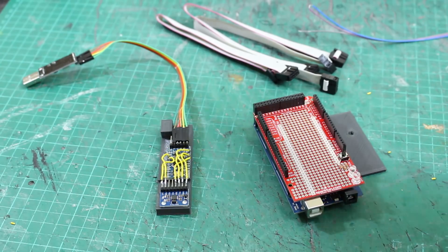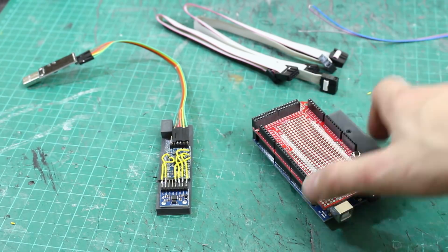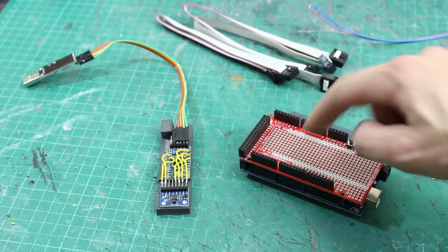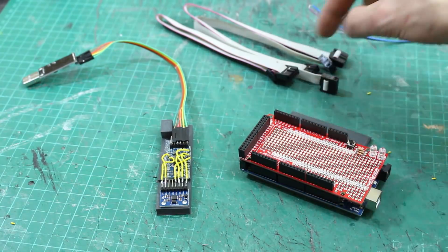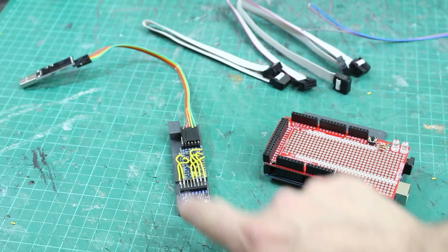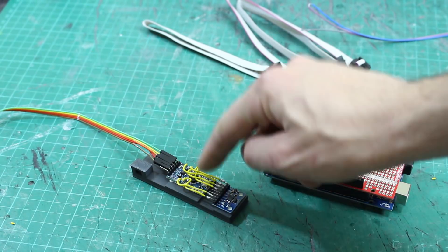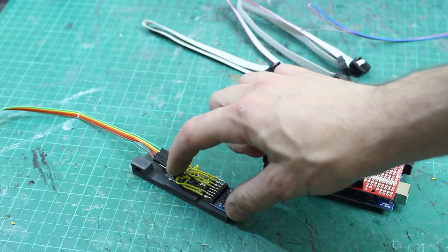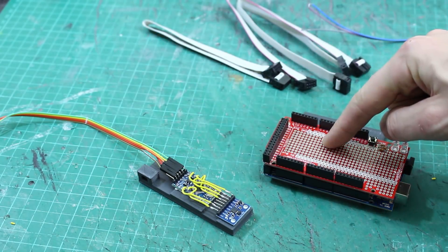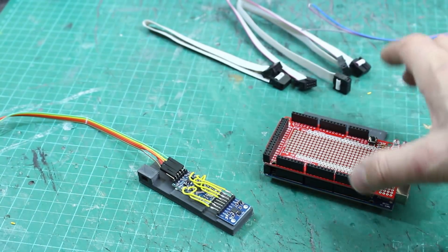Let's look at some electronics. I've got an Arduino Mega here, and this time I've got a shield on top. That's got a protoboard development area so I can basically build all of the circuits on here. Then we can have headers and connectors that go off to the various pieces to make it more modular. I've got the inertial measurement unit here, which is an MPU-6050. That's paired up with another Arduino Pro Mini, and that's gonna sit somewhere in the robot with a connector that comes off to this board, rather than loads of trailing wires — it'll all be nice and modular.